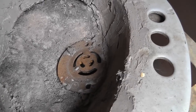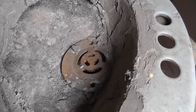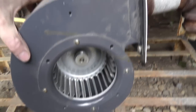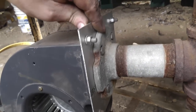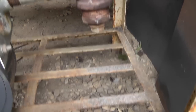This stuff squeegees right on — it looks wet, but it's actually dry. In the bottom here we've got — I can never pronounce this — it's a tuyere. It's the vent. I'm going to show you where the air comes from. I had made one myself but it tended to get clogged, so I actually splurged and bought one from Centaur Forge online. I built a little matching gasket flange and used regular old plumbing to hook it into the bottom of the sink. There's a nut I can remove and let the waste drop out of the bottom — a little bit of a waste gate.